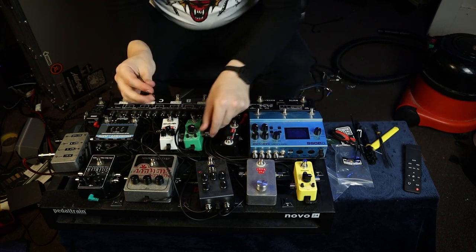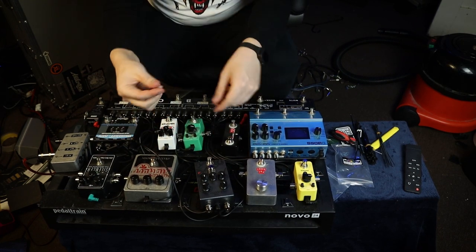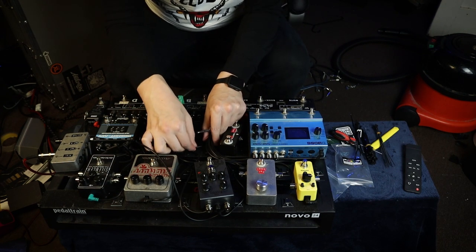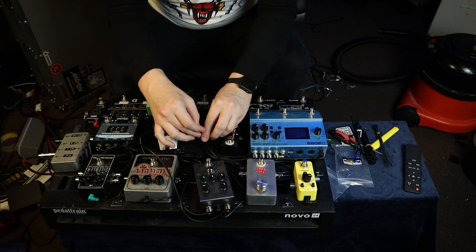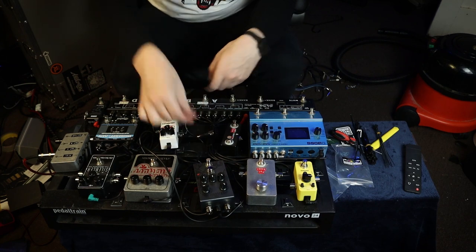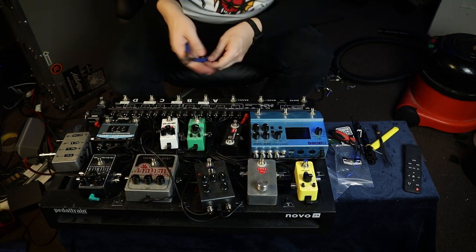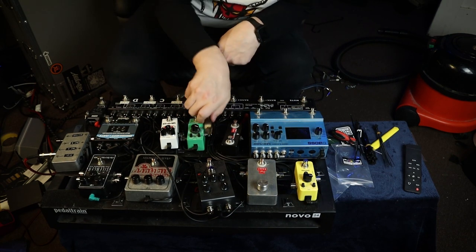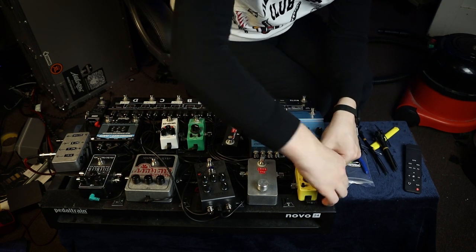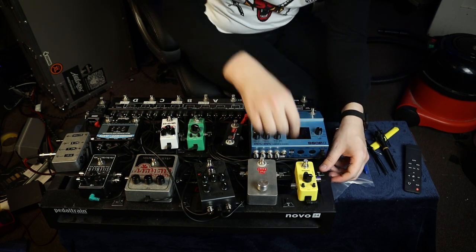As you can see, those cables with a little bit of effort will not be moving anywhere. And that's why I'm happy to use this solderless system, because I know once I've gone through this and cable tied them all down properly - which will require some unplugging here and there to get to the standoffs - these are not going to be moving much. And that's part of the whole robustness plan. I'll pull that one so bloody hard - yeah they're not moving. I'll go along trimming these cable tie ends off as I go.